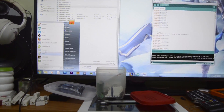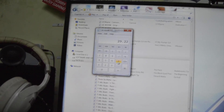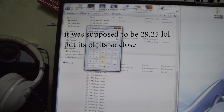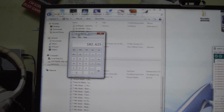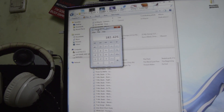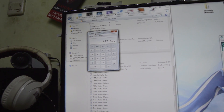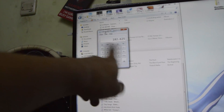Let's get the calculator. It was 29.22 volts, multiply by 6.25 amps — equals 182 watts. At least it gets a bit more than the ratings it has. Amazing, isn't it? 182 watts at absolute maximum power — not so bad. This sub itself was rated at 125 watts RMS and peak at 350 watts. So not so bad after all. Do the same with the average result and you'll get the average power it was running at.